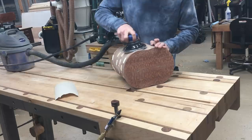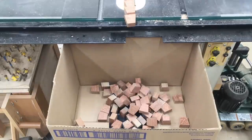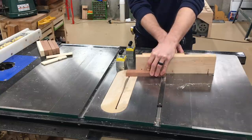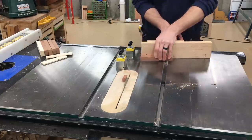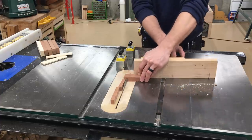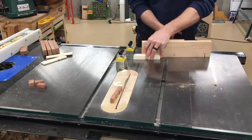And I can't deny that I had the worst table saw accident yet of my woodworking career. It happened when I was cutting segments, which is not something I do a whole lot of. But this isn't just a story about pushing too hard and working tired. A bigger problem is that I had it in my head that serious kickback required a fence for the workpiece to jam against, and that loose pieces to the right of the blade weren't a real risk.